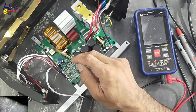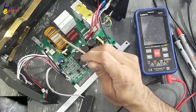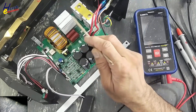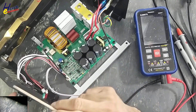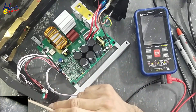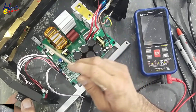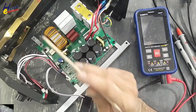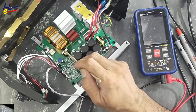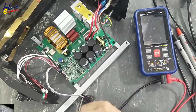That rectified voltage will come out from these two links. Output current in the secondary side is being measured by this current shunt resistance. Current flowing in the primary side of this transformer is being measured by this current transformer — CT. Now we have two types of current measurements: one in the primary side, one in the secondary side. How much current we adjust here is what our requirement is. This IC is forced to provide that required current. It will read back the voltage value from this shunt resistance and adjust its duty cycle to provide exactly the current we need. If at any time there is any short circuit or abnormal condition, the current measured by this CT will exceed the allowed limit and it will create an OC fault — over current fault.